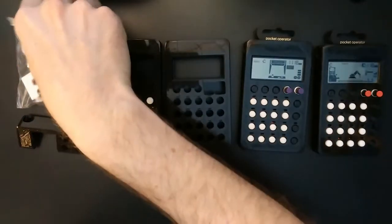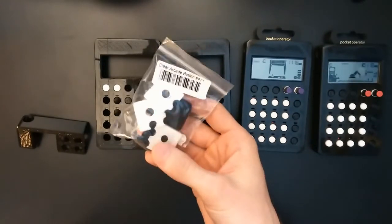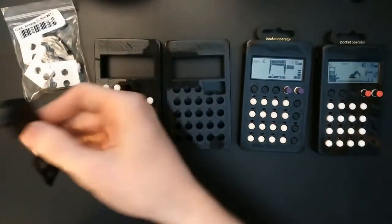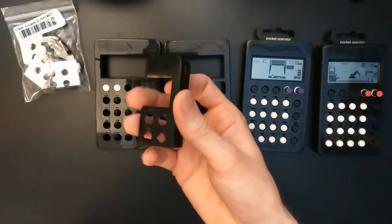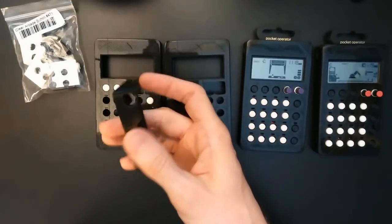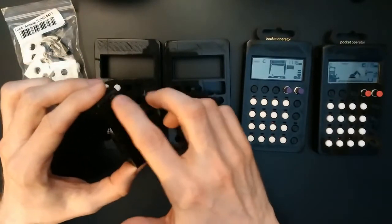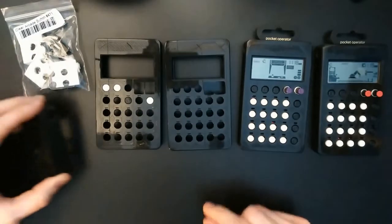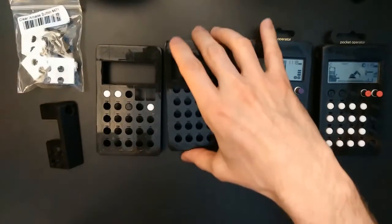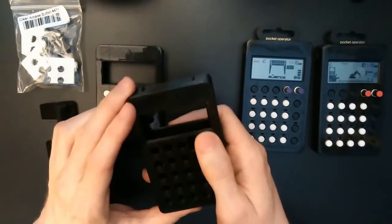First, these are some very early prototype parts, experimenting with different button designs and ways to make the LEDs visible. This is one of the first partial prints to reduce printing time. It tests the alignment of the buttons, display, potentiometers, and also the size of the audio connector up here. These two are the first full prints to test the overall look and feel. The potentiometers were not fully covered in these, as you can see here.